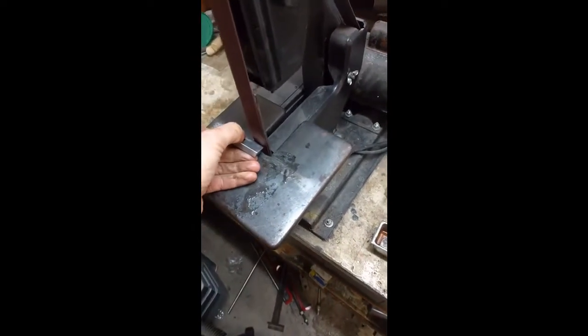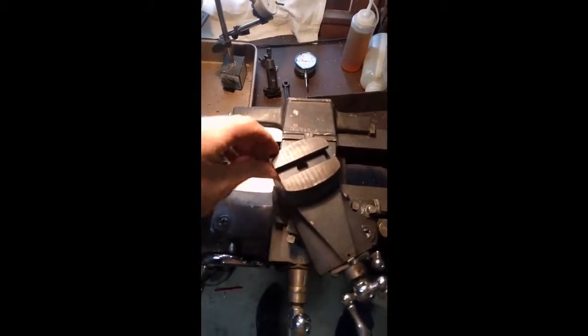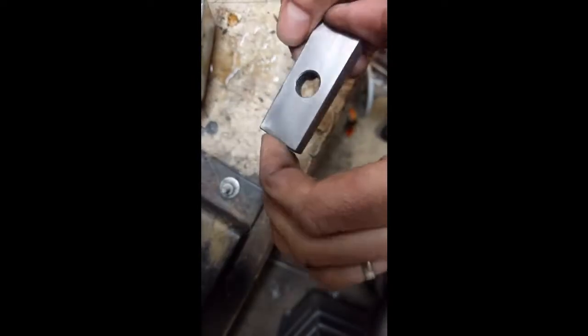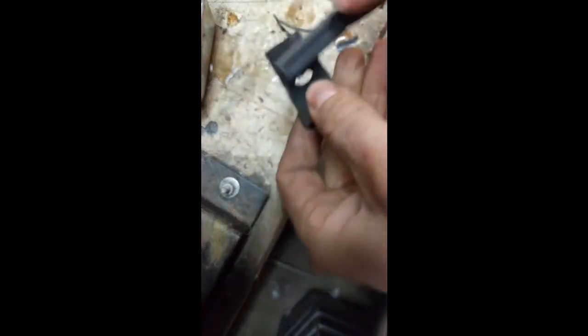I wanted to make sure I had a pretty decent sized chamfer on all edges of this part just to make sure there was nothing sharp and to clear any potential radiuses in the T-slot. One downside of using the sander to clean up the surface finish is that the threads in the part got all loaded up with grinding grit, so I'm just using a small nylon brush to clean out the threads. On the initial test fit I did find that there was a small burr in the bottom of the T-slot that kept it from sliding through the whole way, so once that burr was cleaned up it fits pretty good.